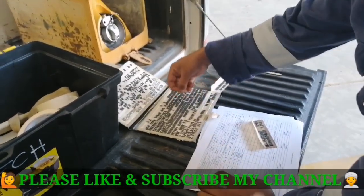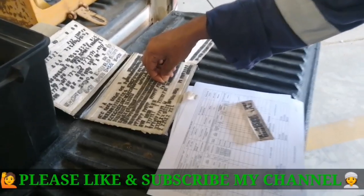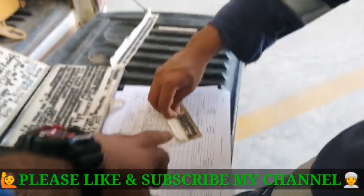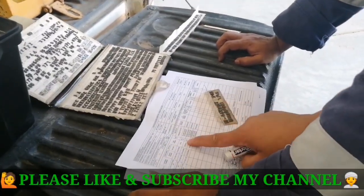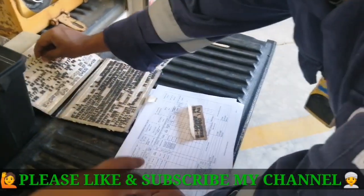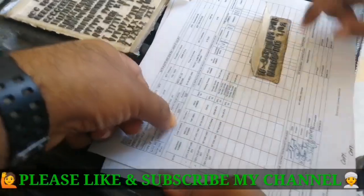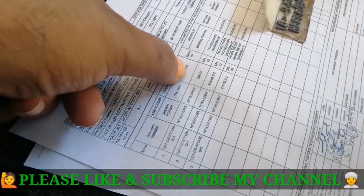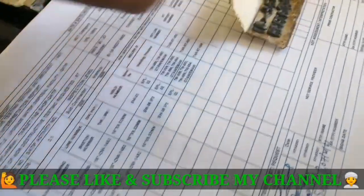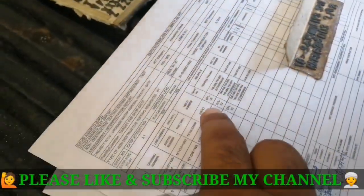As per the request, Mr. Rupesh is going to put the ID and sub-ID. You can see the numbers — for example, IP06, IP3 — as the QC tells which one. Mr. Rupesh is also placing the ID as per the request. You can see on the request there is a drawing number, a sketch ID number, a weld number, and thickness also mentioned. As per the request, he is doing this ID for the full joint — diameter, thickness, and joint number are all included.